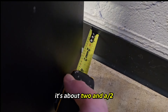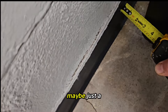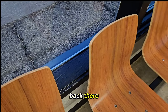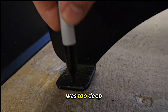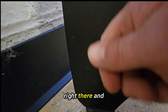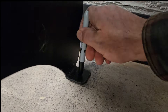It's about two and a half inches to the top of the cove base, and there's two and a half — maybe just a tick back — I want to leave a little space back there for the window washer. Take a marker, and if it's too deep to get a marker in, you can just put a nail or your concrete screw right there and tap it with a hammer to make a scratch. Then you'll know where to pre-drill. Do the other one, then pull it away.